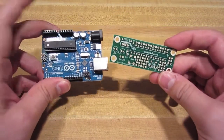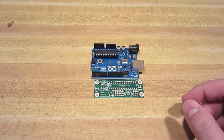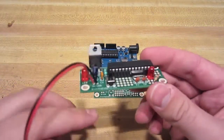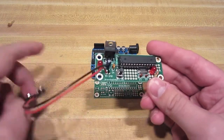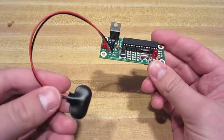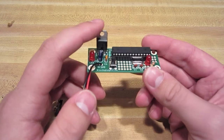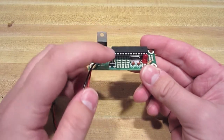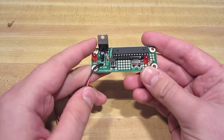As you can see, the cheap Arduino is half the size of an Arduino Uno, but lacks a lot of the bells and whistles. In this finished version, you can see everything on the board. The board contains a 5V power regulator, a power status LED, a reset button, a 16MHz crystal, and a handy dandy 9V power plug. You can plug other sorts of battery packs in there if you'd like, but by default we ship with a 9V plug.